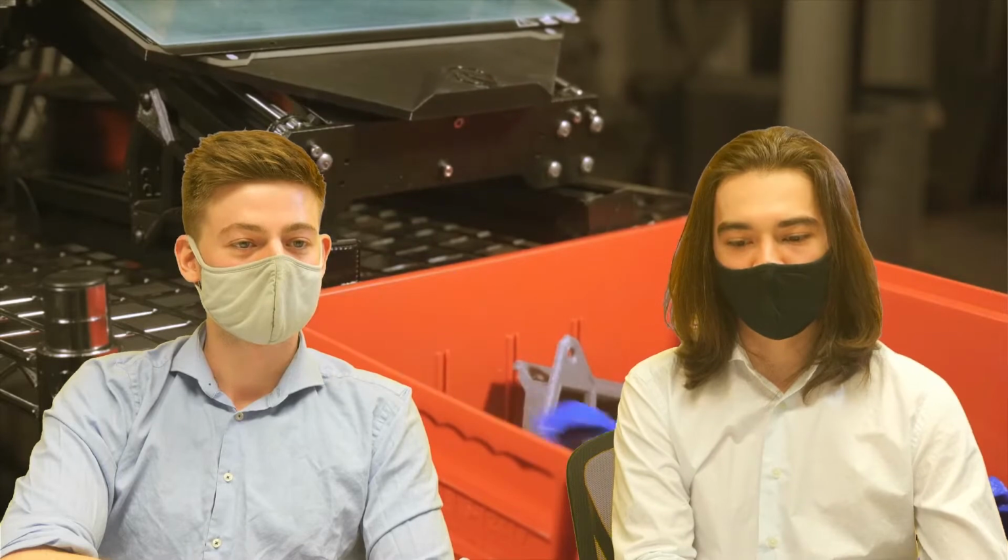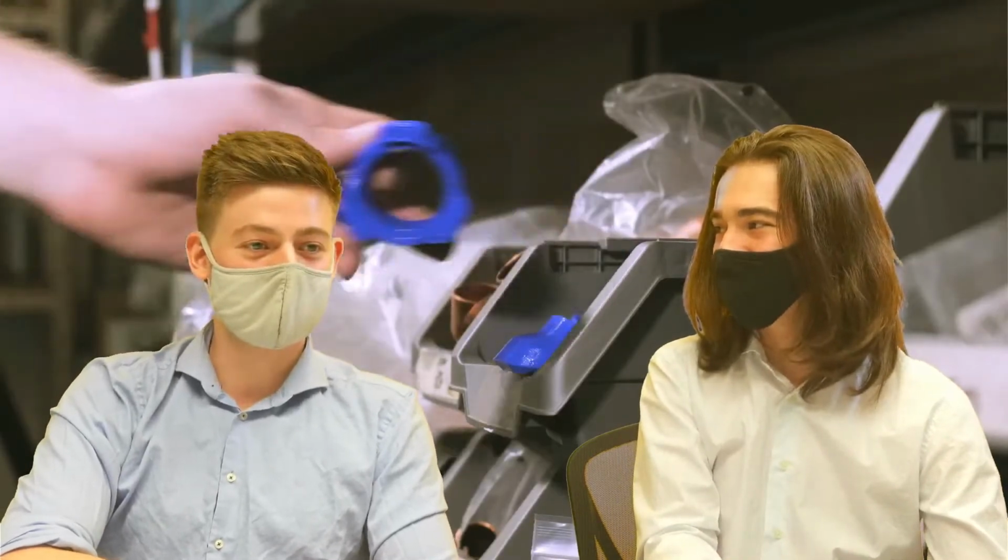Yeah, really weird things happen when you automate, which we have to account for. Like on our Prusa, the bed cable broke. The bed heating cable, yeah, from going back and forth. It's the last thing you would expect to break. So how do we make sure that doesn't happen? It's pretty bad because it's the heater cable. Tons of current goes through that. That's a fire hazard. They had decent strain relief on it too. I don't know how it broke.